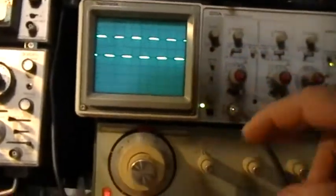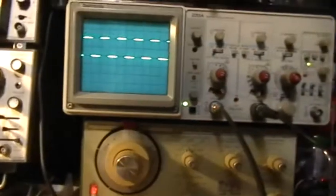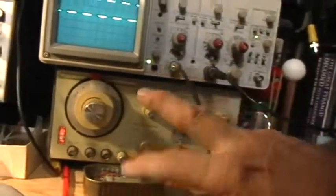This process is actually equivalent to putting a DC offset into the function generator's output. When we hook a power supply in series with a function generator, we raise the function generator's output by the voltage of that power supply. In this case, I've hooked them in parallel, so we're really changing the dissipation and dissipating those powers inside each of the two instruments.